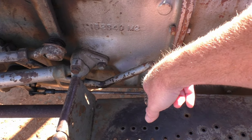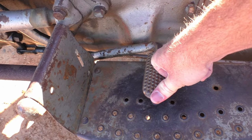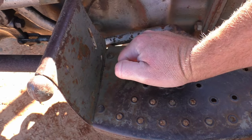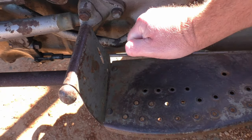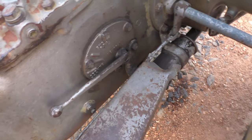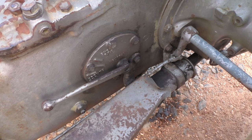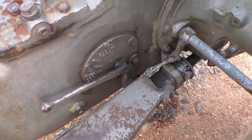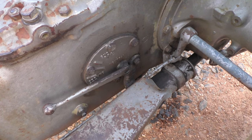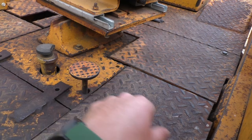On the left side, this pedal is your clutch. This has a two-stage clutch, meaning when you press it down to where it first feels like it bottoms out, that's going to work your transmission gears — the clutch inside your transmission. If you go farther than that, which is just a little bit farther and takes a real heavy foot, you get that second stage of the clutch, which cuts power to your PTO. You may also have a pedal somewhere right down here that this tractor does not have — that's a differential lock. You press down on that pedal and it'll lock both of your rear tires together to give you a whole lot more traction. That's the one feature this tractor doesn't have that I really wish I had. This is my John Deere backhoe, and this is that same pedal — the differential lock — what it looks like.